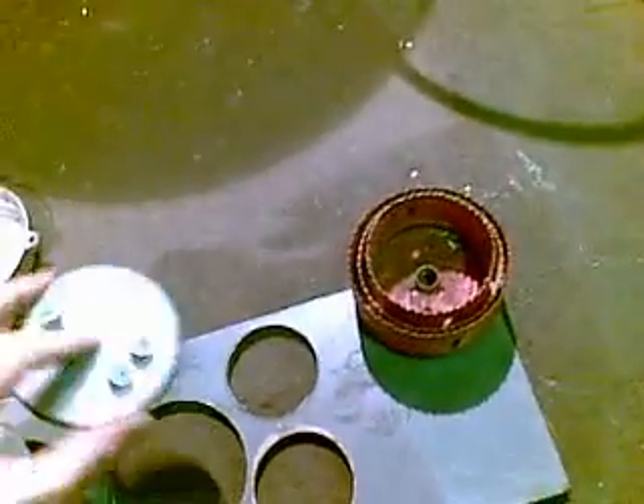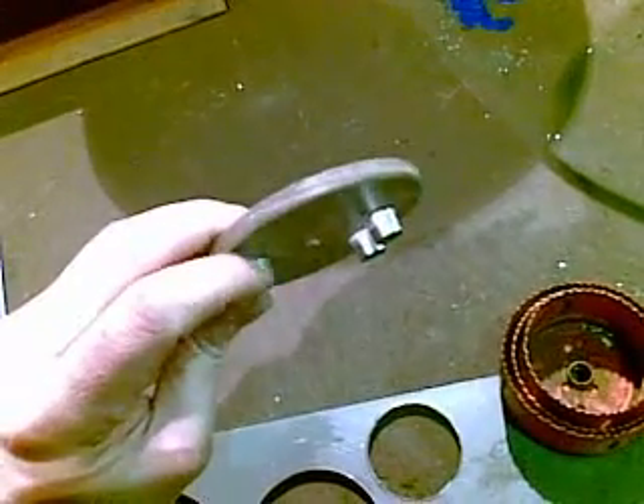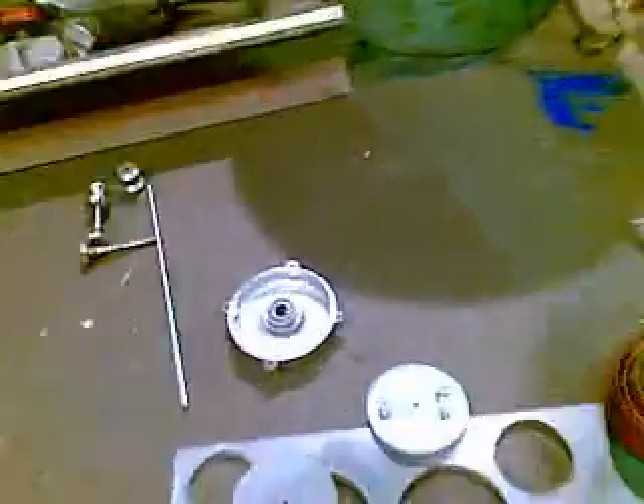Here are the things I cut these holes with. These are pen lids - they look like metal but they're actually silver plastic. I wouldn't use metal, it might scratch the enamel. Don't use absolutely no metal - nothing which will scratch your copper enamel.